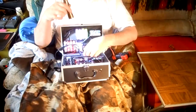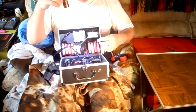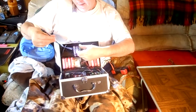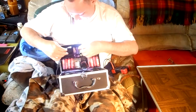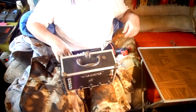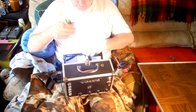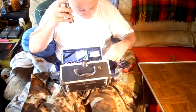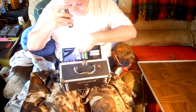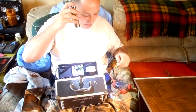Then you can plug in a laptop power supply — like 19.75 volts, 4.5 amps — and it'll work fine. I use one of these multiple adapter cables, it's a four-in-one although I only use three. That gives you parallel wiring, and what that means is each one of these packs is 16.5 volts or so, and when you combine them it just gives you more current — more milliamps — and the power will last longer.